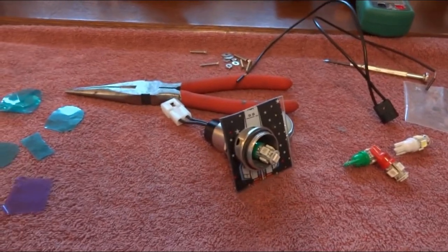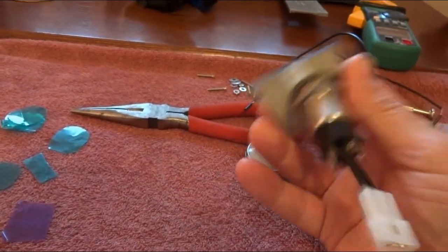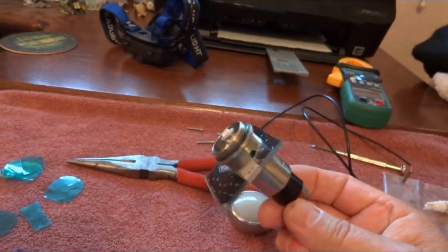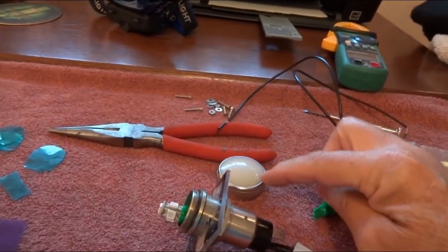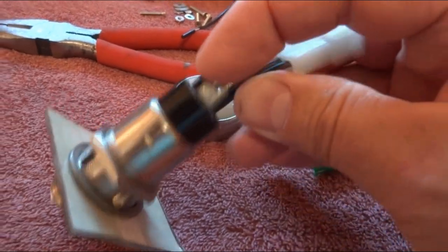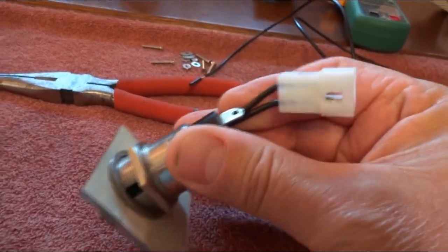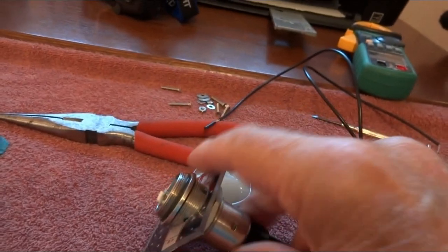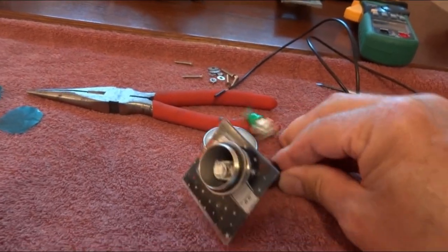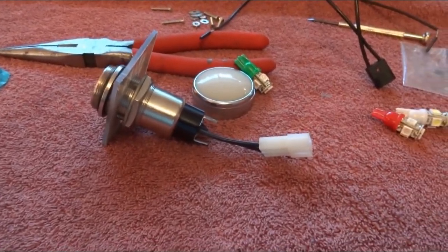I hope you guys enjoyed that. It's pretty simple and straightforward. One more suggestion before you go: make sure the LED is pushed all the way to the back so you get a nice spread and diffusion across the cap. Then I'd take a small zip tie and tie it right through that hole to secure the wire, so it won't sneak forward. You want it as far back and centered as possible — tie it off back there and it'll stay. Alright, that's all I've got for you. Have a great day, see you next time!